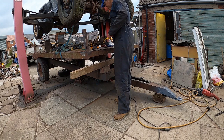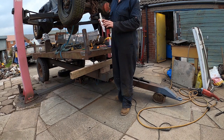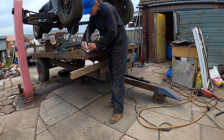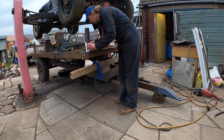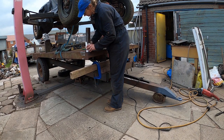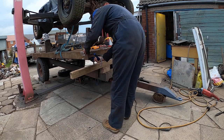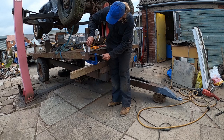With the box section in place, I have got some cardboard which I'm going to use for shims. Because when I weld it, I know it's going to contract and it's going to pull. So I don't want it to shrink to the point where I can't get this out and can't get the actual piece of box in. I'm going to pop them in there like that. The next thing I need to do is get my G-clamp in position — I'm potentially going to run out of hands. Once the G-clamp's on, I can tap it to the correct position. I'm just going to get my shims squared up a bit better.